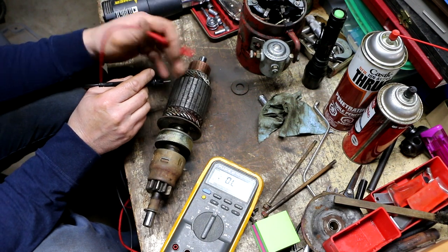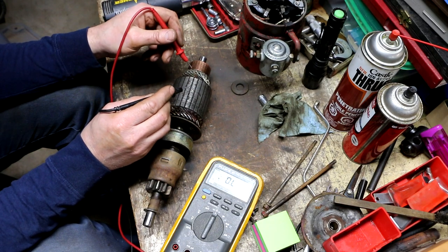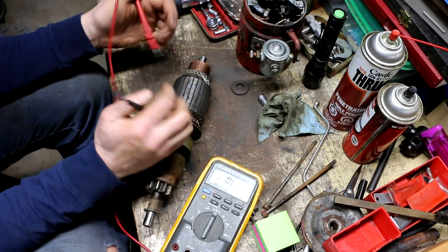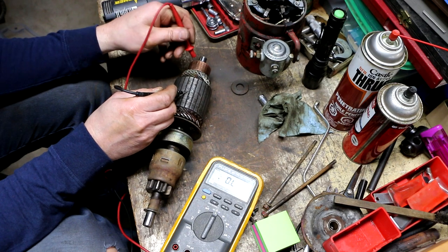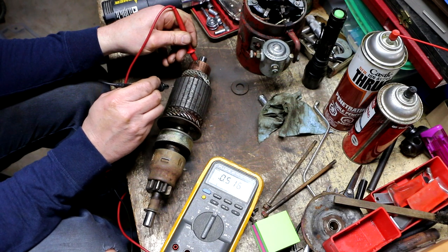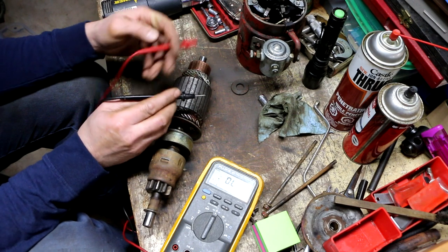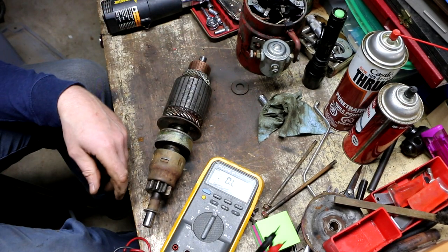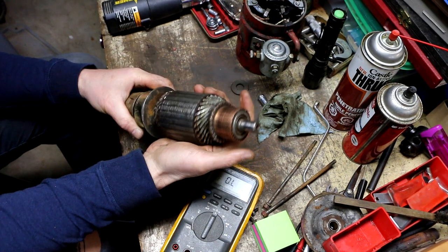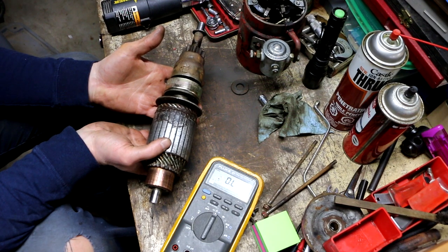I went outside and blew it out with compressed air again. I don't know whether the air cooling it caused the resistance to come back up, or whether heating was sweating parts cleaner out and then I just blew it off. But now it starts at over 470k ohms and rises — over 500k ohms. Resistance has gone up a lot. I'm at this point tempted to just slap this thing back together and see if it'll actually run. Maybe I'm overthinking this. I did find the starter online last night — looked like it might be the correct one for this tractor — and it was like $250.